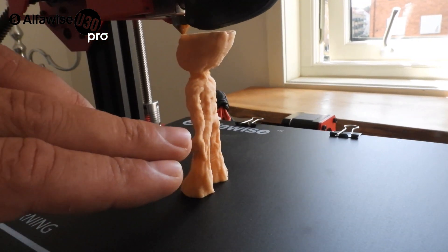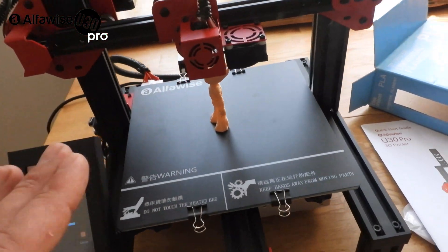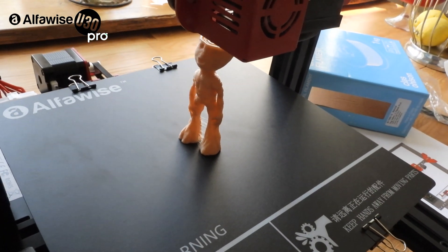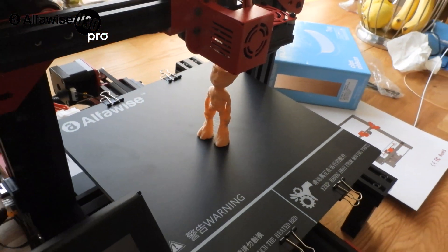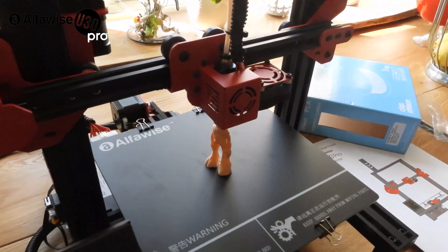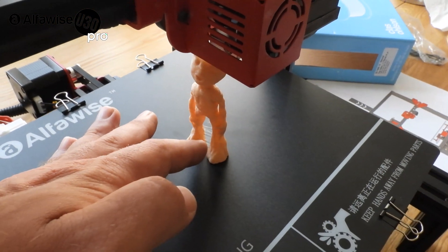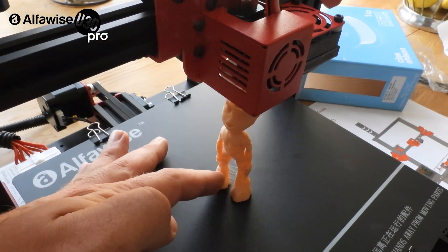Check it out — it's really, really nice, and remember this is directly out of the box. 30 minutes and I was ready to go, no tweaking, nothing. I'm using Ender 3 settings. The stringing is because of retraction — I think it's too much at about three to three and a half millimeters, that's why I'm getting stringing.